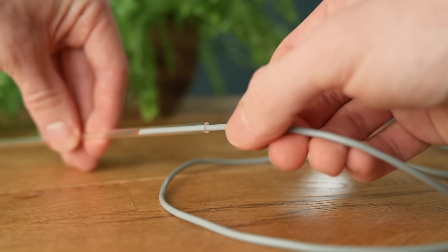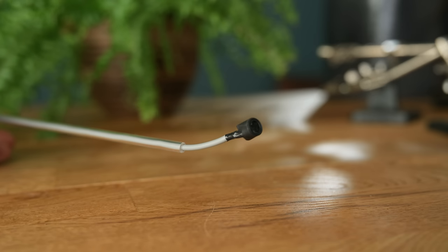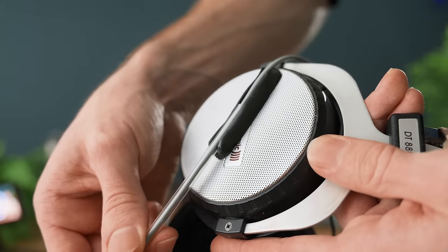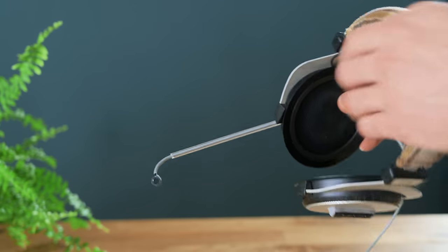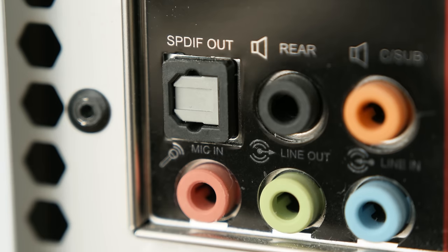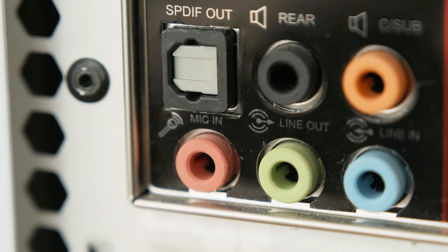Making this is quite simple, first requiring the microphone's wires to be soldered to a shielded audio cable. This shielded cable prevents buzzing and interference noises, so is quite important. Now we can thread this wire through a small piece of plastic tubing, leaving a short length of wire at the end for adjusting the microphone's position. To mount it to your headphones, the easiest way is to mould a small clip out of Sugru. Once dried, the tube can be slid in place and adjusted as needed.